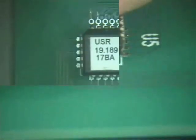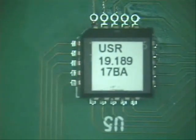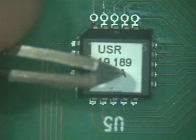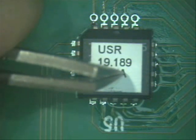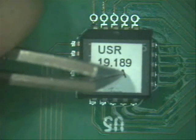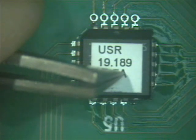Then I am going to come to the last side, noticing that it is centered there also. If you notice that it moved just a little bit, when you come in to tack it, just be very careful — not moving it much with your tweezers. Flux it up just a little bit right underneath there. I am using a no-clean flux. Clean off my tip very well into the center hole, go to the outer edge and finish cleaning. Add a little solder to the end of my tip — the area that is going to hit the board. Then come up underneath here, hit the pad and slide into the lead. See the solder come up — nice and shiny — then come right off.